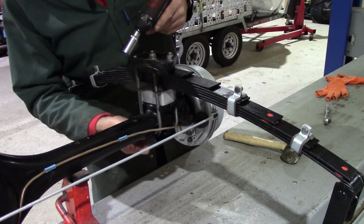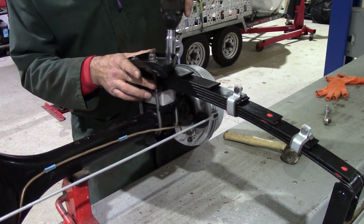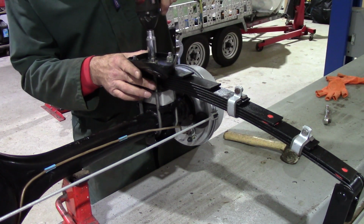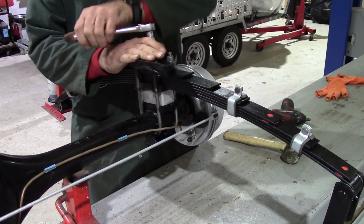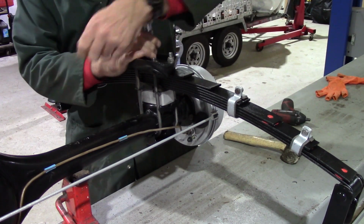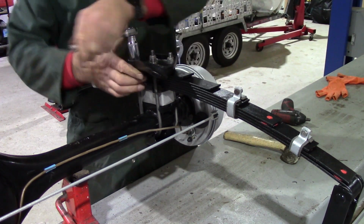Just as you're tightening these down, make sure that everything's seated properly in the right place. And try to tighten them down evenly, so that you've got the same amount of thread sticking through, and then finally tighten them up by hand because you've got better feel of how tight it is. Guns like that are great for just taking it down the majority of the way. That's a fairly lightweight gun, it doesn't impose a lot of torque. Again, I couldn't find a specific torque for these nuts.